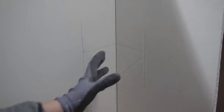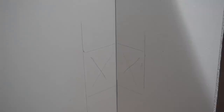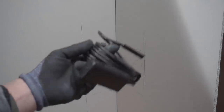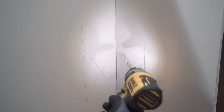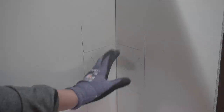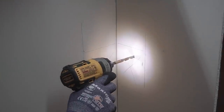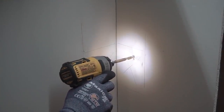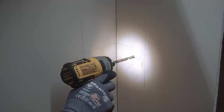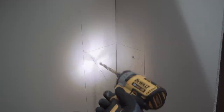What I highly recommend, before you go and start cutting around your wall, is to check what's behind there — whether there's existing wires or piping. I like to use this endoscope right here, but first we're going to have to drill a tiny hole. I highly suggest you do this on each side because it's a different surface area and you don't know what's running on each wall. Just gently drill a small hole through the drywall — you don't want to put too much pressure because you don't want to inadvertently drill into something.